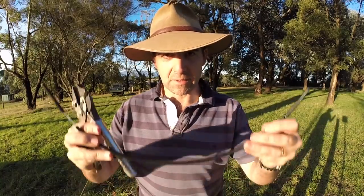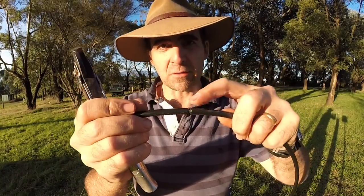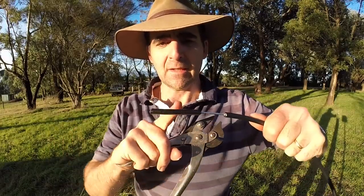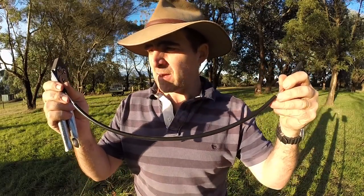Now I'm just hooking up my hot wires with a piece of insulated wire, and I'm going to show you a trick to save you a couple of dollars. You know those little screw-type attachment things that people sell to hook up hot wires? You don't need them. All you've got to do is cut some insulation off from around your insulated ground wire, pull it out a little bit leaving a bit of a handle, then tie this around your two hot wires. They're joined together and you don't have to spend about six dollars on clips.